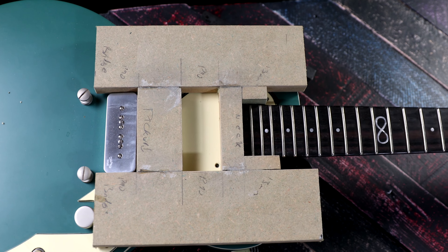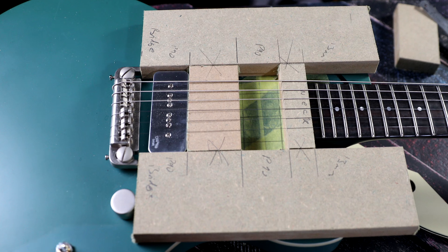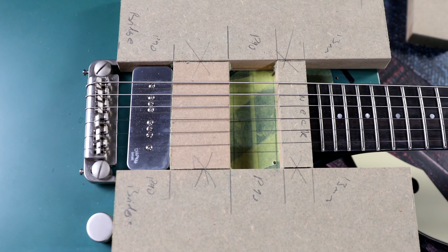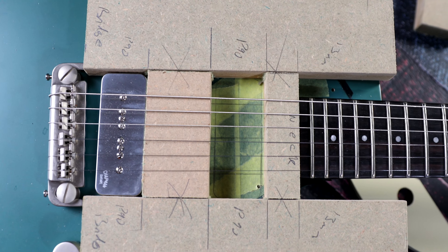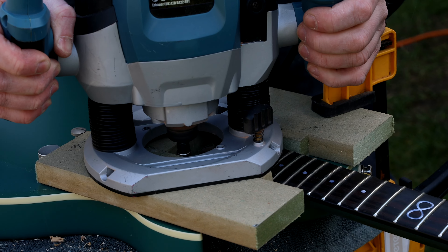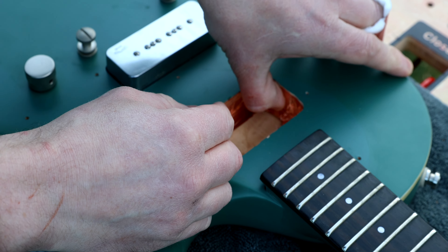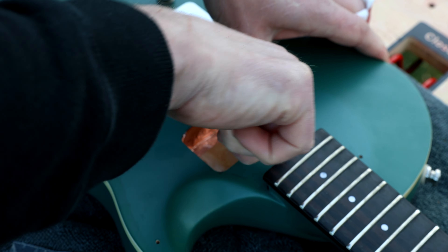Cleverly, the pickup cover has six holes in it so you can tell when it's aligned with the strings, so you know it's in the right position. I then got some 18mm MDF and made a jig that fitted around the existing bridge pickup and the neck pocket just so it didn't move. It had a slot in it which is slightly bigger than the pickup cover — about an extra millimetre around each edge — so it has a bit of movement. I glued the jig together and used a forstner bit to remove a load of the material within that slot just so the router has an easier time.